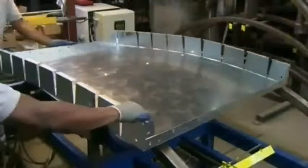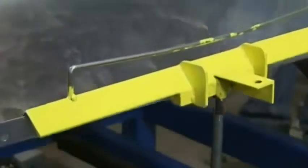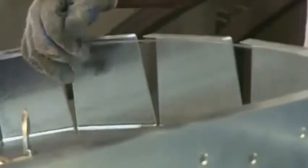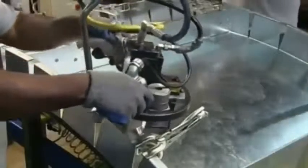To make a curved panel, they place it on a fixed radius jig. They insert a metal profile called a stiffener and bolt it in place, using a custom flat head bolt and nut that will lodge themselves in the metal dimples. Next, an automated clamp bends the panel to fit the jig's curve. The V-shaped notches allow the panel to bend easily, but workers must install radius belts to maintain this shape, fastening them permanently using hydraulic rivet guns.